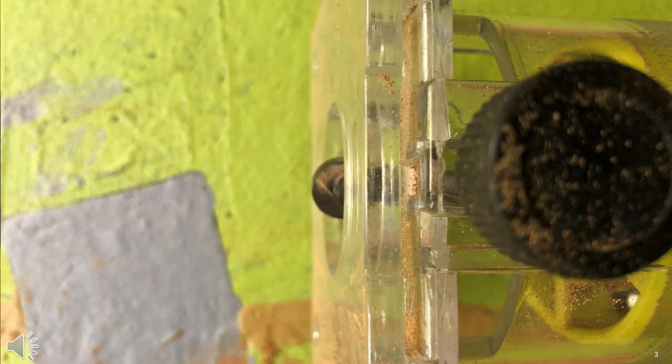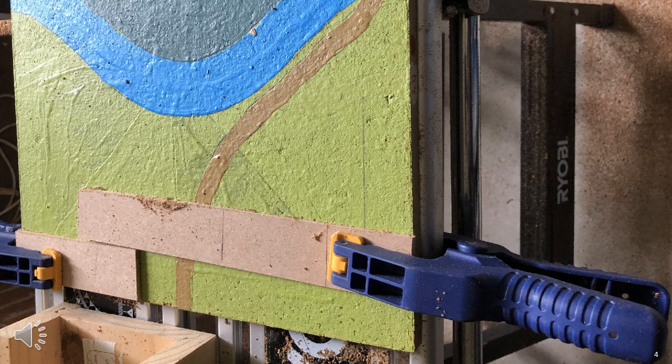This is set so it cuts into half of a single tile, perhaps 3mm depth. Draw out your river on the tile, secure the tile to your workbench, use eye protection, and route away. It's important to ensure the tile is well secured to a workbench during the routing process — you do not want the tile to move. The area which will be routed is shown in blue.